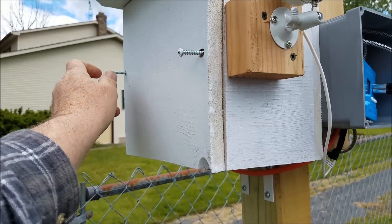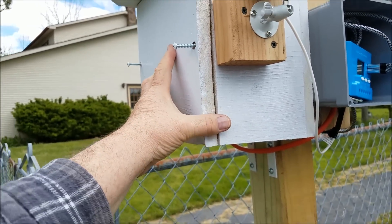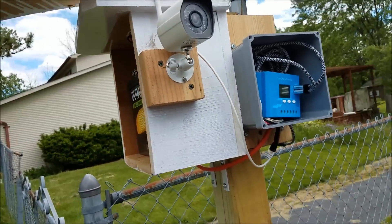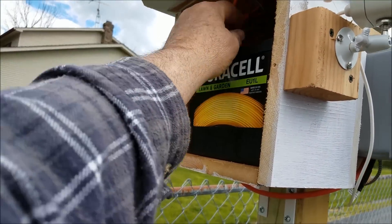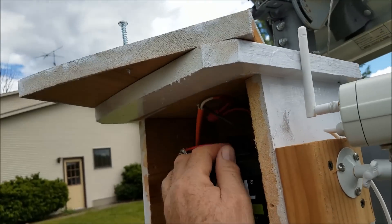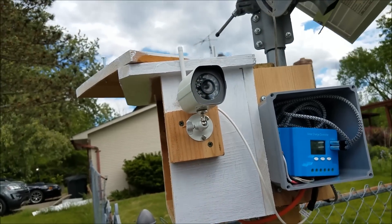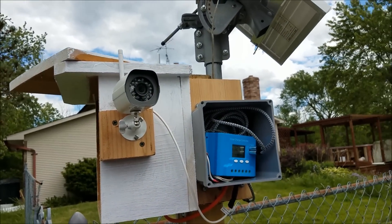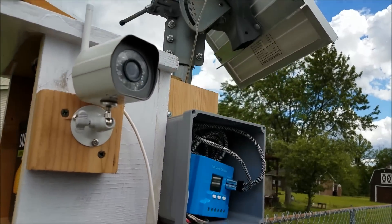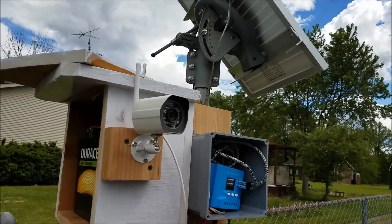This is just in case Troy ever watches my video, because I've been hammering that poor man about fuses — which I'll bet he has never put on yet. But fuse right at the battery — that's where you want your fuses, as close to the battery as you can get them. Why do solar guys set up a beautiful setup and then put all their fuses right underneath their charge controller and run a six or eight foot wire from the battery to it?